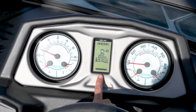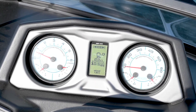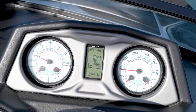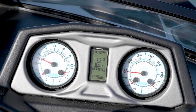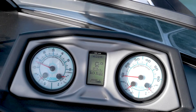When you're dropping the power wedge on an Axis, you just hit wedge down and it's going to put it all the way down into lift mode. Then you wedge up until you get to the number you want. You can do that while you're moving — so if somebody's back there and they want more push, want it steeper, you can go to two. You can do it on the fly while somebody's back there.